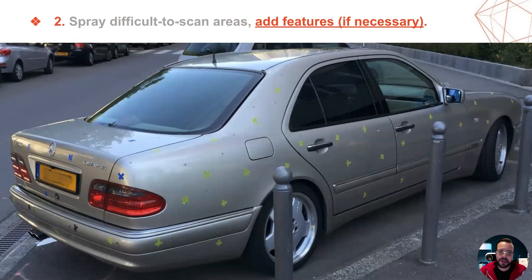Here is a picture of a vehicle completely covered in texture references prior to scanning. This was an experiment we performed back in 2015 with an L2 scanner. Nevertheless, adding texture references — for example in the form of masking tape crosses — is just as valid today as it was back then, especially if you ever need to scan a car with large, flat body panels. Similarly, when scanning a car with an EVA scanner, you will also need denser features, because the EVA scanner's field of view and scanning range are both noticeably smaller than those of the LEO.